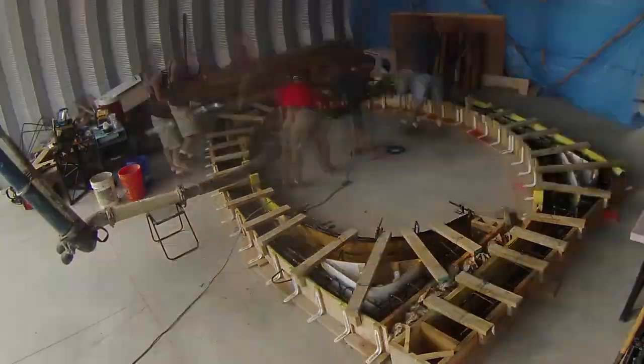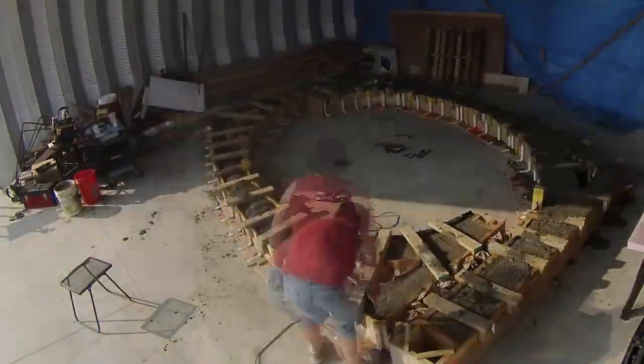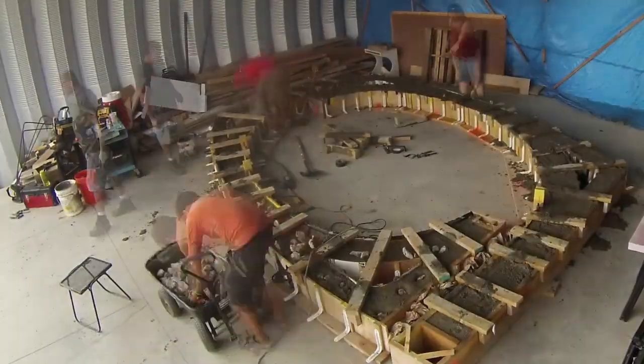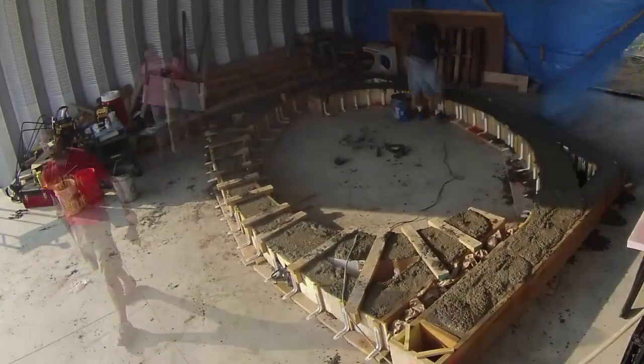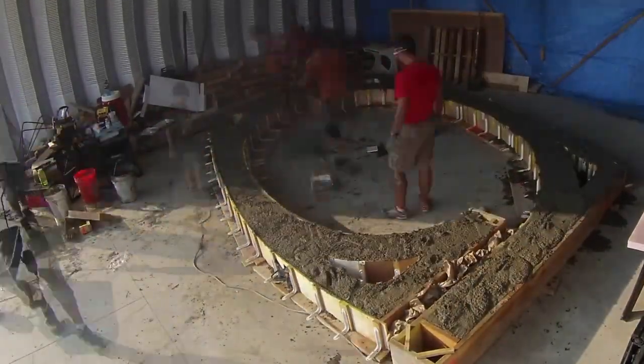The concrete was poured along with the floor, because I thought I needed the pump truck, and I didn't want to pay for it to come a separate day. Aaron and Ryan and his son Carter came out to help. Unfortunately, the pump truck wastes a lot of concrete, so it looked like we wouldn't have enough, and we had to add some rocks to bring the volume up. We vibrated them in nicely.